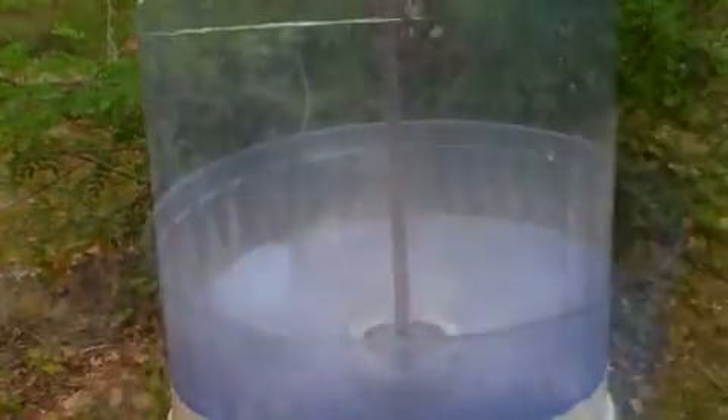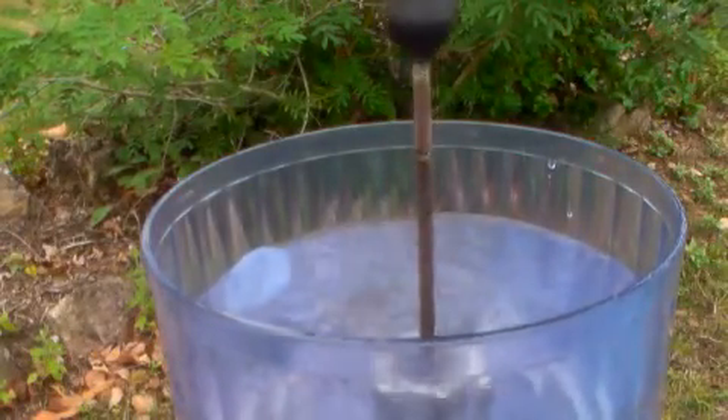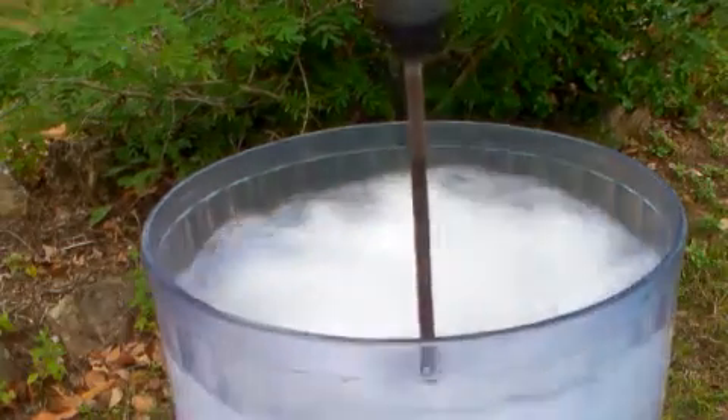This type of aeration — a commercial model that I've designed and built — operates on 1.5 kilowatts. You would need probably two to service a one hectare pond under full production load. I've slowed it down a lot so you can actually get an idea of what it does. Its operating speed is a lot higher, and the pressure generated is sufficient to oxidise nitrates and nitrites.